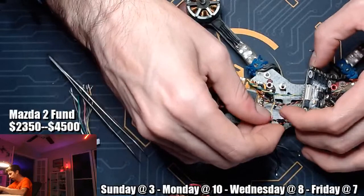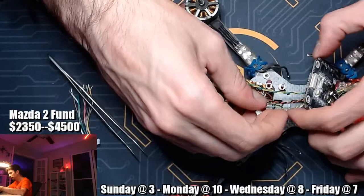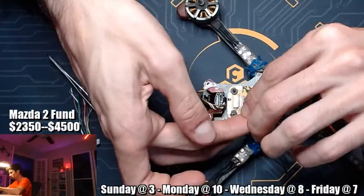It seems to be working okay. It takes a little bit of the stress off. It's just one less thing being powered by the 5-volt BEC on the flight controller, which is kind of a good thing, because the flight controller BECs do have a tendency to blow up. I've absolutely had that experience. So, yeah, I don't know.